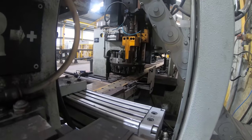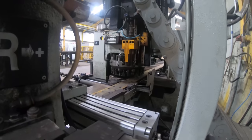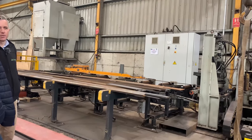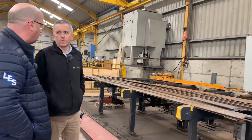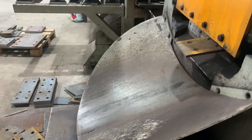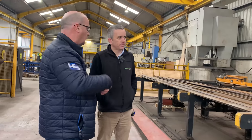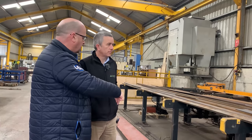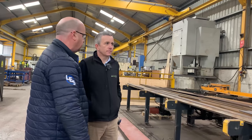I see lots of drill heads on that there. That's right, and also punching. You can punch square, oval holes, round holes, or whichever you like. And why wouldn't you just punch everything as opposed to drilling? On certain jobs, punching isn't allowed in some commercial jobs because the actual punch hole can be slightly angled on the plate. The drilled hole is obviously a truer hole. And also sometimes you might want to put threads into holes in plates, so you use your drill to drill the plate and then it will also tap the hole in the plate as well.